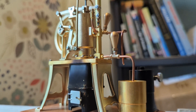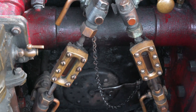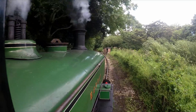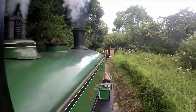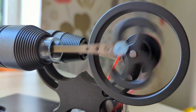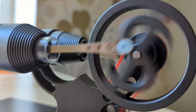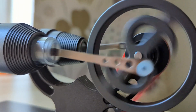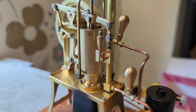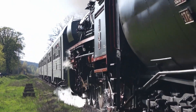As a machine, this is far less complicated and remarkably simple. Most importantly, you don't need a source of water for it. A steam engine uses up the water — it's expelled out of the chimney and it's gone. A hot air engine is a closed system: the air that expands and contracts inside the machine is the same air, trapped in there, it doesn't go anywhere. This means it could be used in places where you didn't have access to a lot of water. Obviously this model has water cooling, but it doesn't really use that much — you'll lose a little by evaporation, but nothing compared to a steam engine.